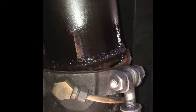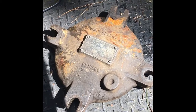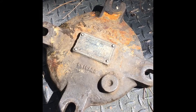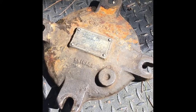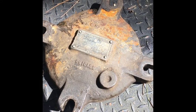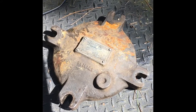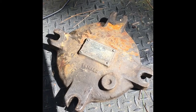It's the NAPA equivalent of a 1297 filter, pretty readily available from local parts stores. We're going to take that one out and put a new one in before we put fresh oil on this locomotive. This is the cover that goes on the Nugent oil filter in the nose, made by the Nugent Lubricating Oil Filter Company — they're still in business, or you can at least still get the parts: filters, gaskets, and things like that. Mid-Continental Diesel also has the gaskets available as replacements, but like I said, it is a NAPA 1297 filter.